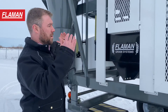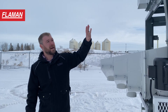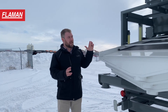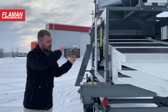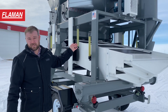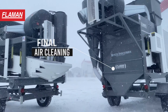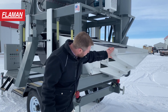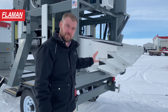When comparing this to the Bench full-size cleaner, we're going to notice it's longer. It does still have a cyclone where we capture all of the light and fine debris that we pull off with the air system. But the biggest difference when looking at the market cleaner versus the full-size cleaner is how it comes out the back. Typically on the Bench full-size grain cleaner there's an air chamber right here which gives us a final air cleaning that we can pull any final debris off. This is where we get all the versatility in the Bench market cleaner.